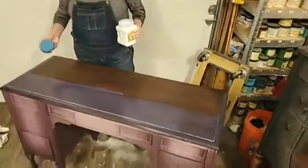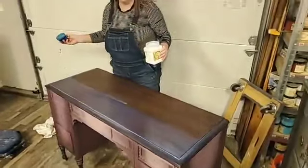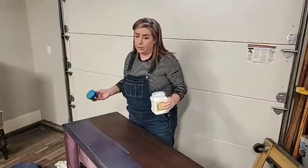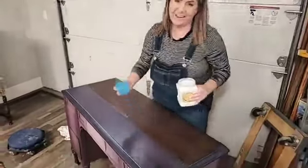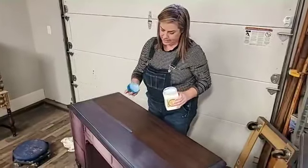I can put 2 to 3 coats of satin and just do 2 coats of gator hide on top. It doesn't have to be all 5 of gator hide. So I like working with satin better, but I like the protection of the gator hide. So combine the two, put the gator hide on top, and you get that extra protection.